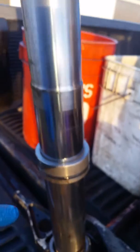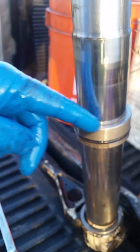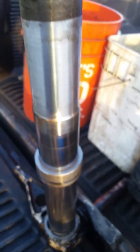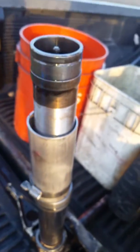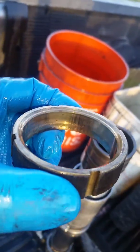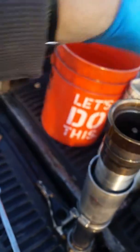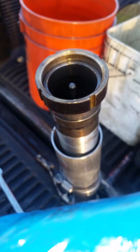Now I've put the ring back in place. You want to make sure that this ring is on the bottom and your slip ring is on the top inside. Next, we're going to slide this assembly down over the top. Then if you look at this ring, this ring has a chamfer on it — that chamfer goes up. It's put into place and then we'll put the ring around it.